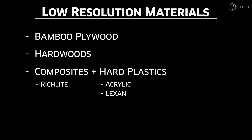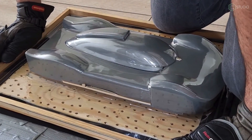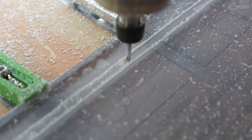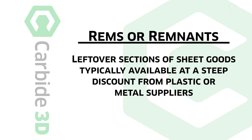Lexan is another one you can try — you might be familiar with it in RC car bodies. It's vacuum formed in a very thin sheet, but it also comes in very thick sheets. The clear Nomad behind me is made of Lexan and it machines wonderfully. Again, you have to make sure that you're making chips, not melting the material. Go to a plastic shop, ask to see the remnants, and experiment with those things — you can add a color pop, a material pop, something different to a project, and gain experience working with new materials.